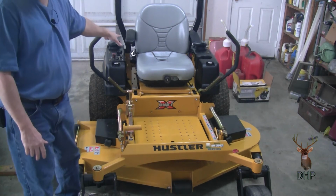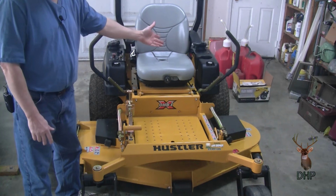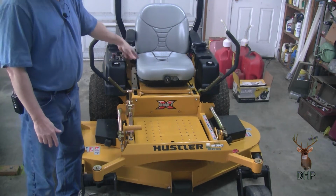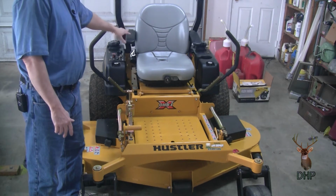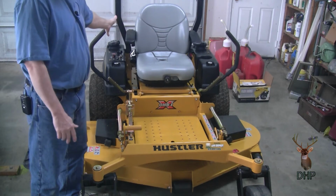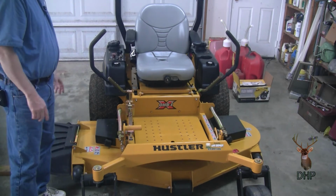The Ferris 2100 I looked at had 2 tanks, but there's not a shut-off between them. So if you happen to pull a line or puncture a tank, you're out of gas because you're tied between the two of them. It's just a valve. So to me, that looks like I'd rather have a few dollars put in a valve and know that if I had a leaky tank and I'm a few days from getting one in, I can go ahead and leave it on the right or the left one that's not damaged and be able to go. It's operated off the back and it's easily accessible back there.